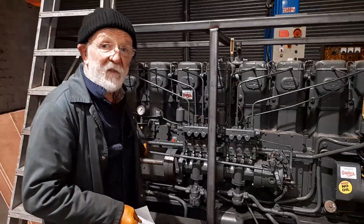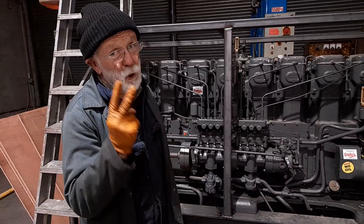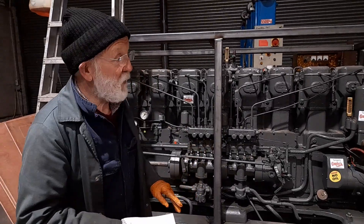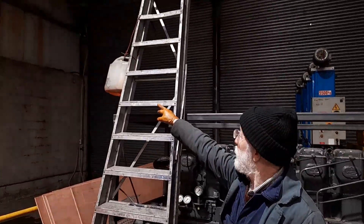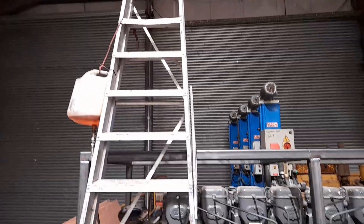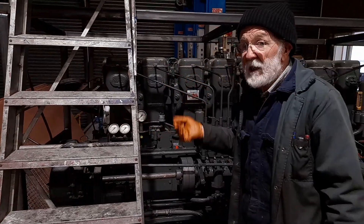This engine has no lift pump. But where 8L3Bs are fitted with lift pumps, they fit two lift pumps, just to be sure — if one fails, the other will take over. Because there's no lift pump in this engine, we've had to rig up this Heath Robinson fuel supply system here. In a real boat, you would have to have a day tank and pump the fuel up to that. The fuel is fed down to the fuel filter simply by gravity, so it's one less thing to go wrong.